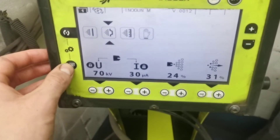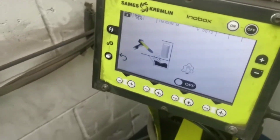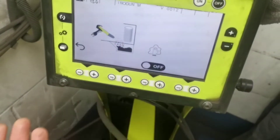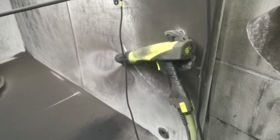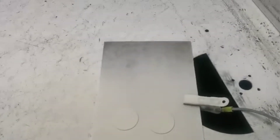I found out that when we clean out the gun, it's on a timer — not unlimited, it has a set time until it completes the cleaning cycle. So instead of having to take apart the gun each time when we switch powders, we just let it run its cycle and it will get rid of all the contaminant from the previous powder.